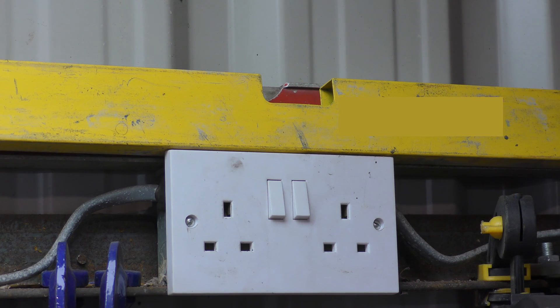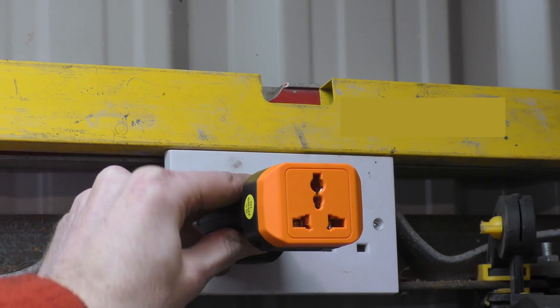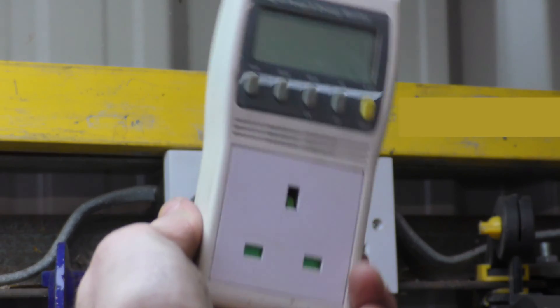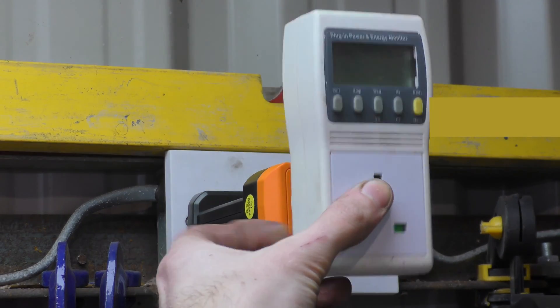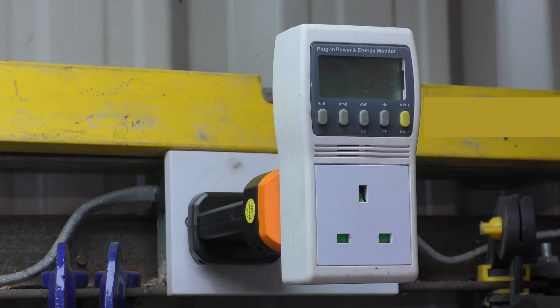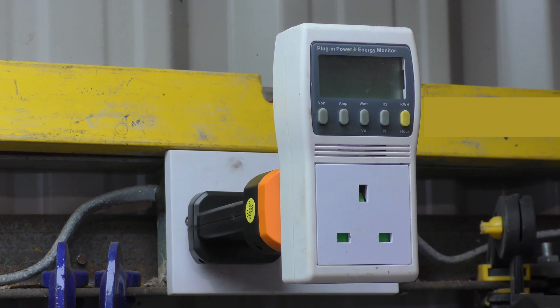Alright, here is my aforementioned socket. I'm going to plug the adapter into it and then I'm going to plug in the typical power meter — you know the one, you press the button that tells you power factor, current rating, voltage, all that. I'm going to plug that into the end of that. It's getting a bit precarious over there. Then we'll plug our load into the end of that, put a clamp meter on it and see what we've got.